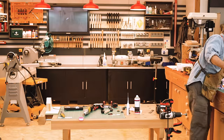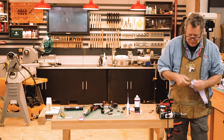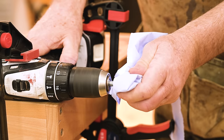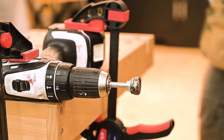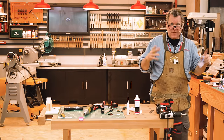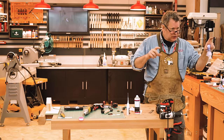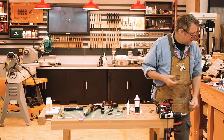And I would then dry that off. Now from there, again, this might be acceptable enough, and a paper towel works. And I can do polishing compounds. So there's automotive polishing compounds, 3M, or I don't know if you carry Nova is another one, Magic Juice. There's a variety of polishing. They have different levels, and it's just grits in a liquid, and you can use polishing compounds.